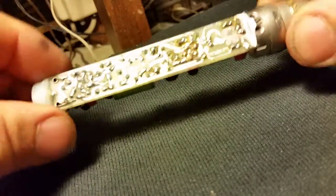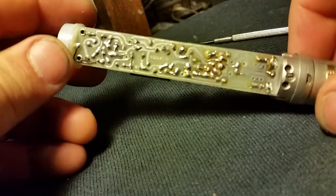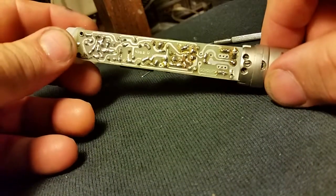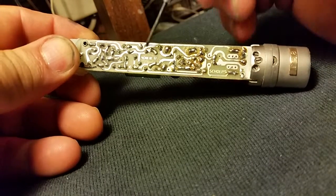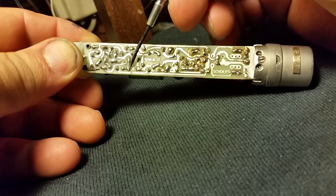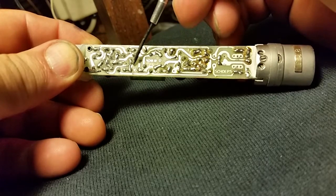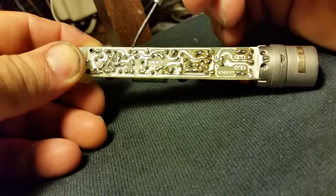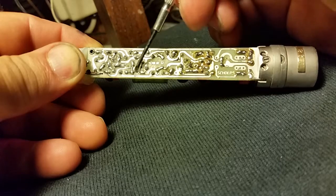Handle the thing by the edges or by the base. Now, if you look real closely here, you will see a jumper. It's right there — you see it's jumping, it says B and A, and this jumper right now is crossing the B, and that is making it a non-blue dot. We're going to take that jumper off and have it go vertically here to the A.